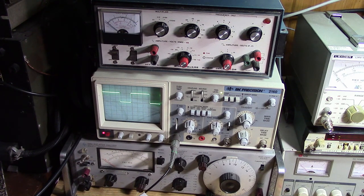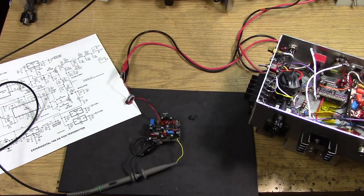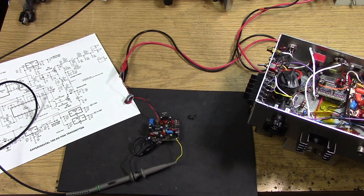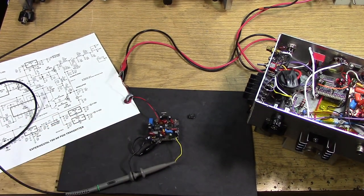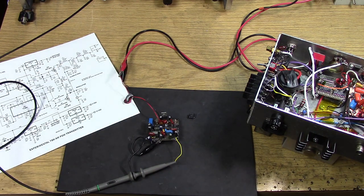One potentiometer sets the duty cycle of the 555, and one potentiometer sets the output duty cycle for modulation. Also on board, just for completeness, I did put the audio amplifier for the microphone and some low-pass filtering. I've now got a jumper that I can remove to remove bias, so I can handle either electret or dynamic microphones. And we only have two regulators on board.